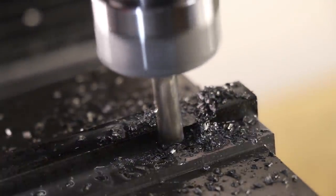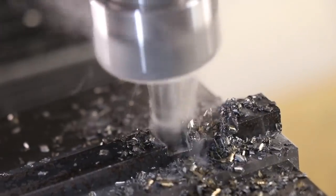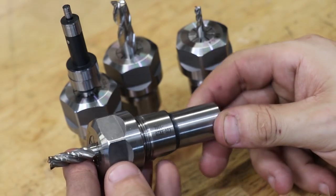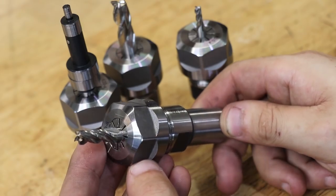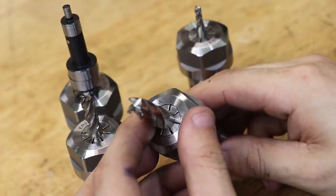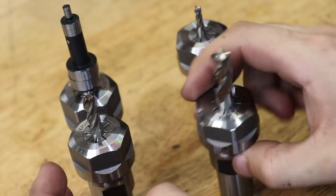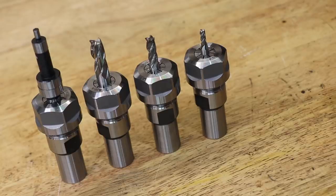Overall I'm really happy with the results. This is what I was aiming to achieve the first time I did this — 10 microns of runout, easy to change the tooling, pretty affordable. It pretty much ticks all the boxes. I'll probably use this setup from now on. There are still one or two more things I'd like to try though — I wouldn't mind making up a Weldon shank side locking holder, and possibly some shrink fit tooling for some carbide end mills. But that's going to have to be for another day. Anyway, I hope you enjoyed this video. Thanks for watching, I'll see you next time.